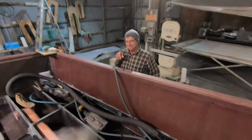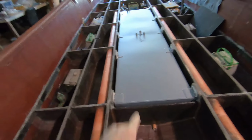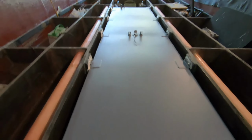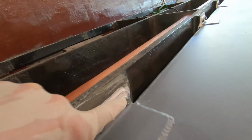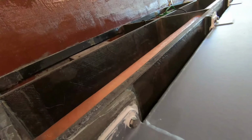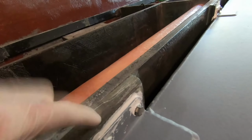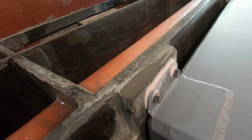But you can see we've got all 4 corners, and I got my brother over there. What's happening, Mark? Right there, y'all. There she is. That has kind of been a big deal. Looks familiar, you can see it, but now she's in the primer. That is the Interlux, the 2000E. You can see she is now lag bolted to the sides. We got the sealant called 5200 in the seams. These hard points are all bolted and glued in.